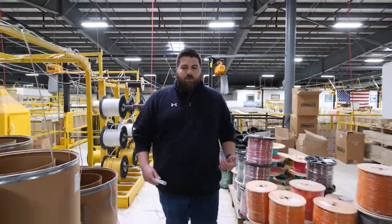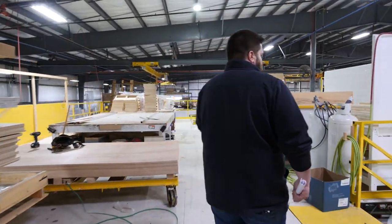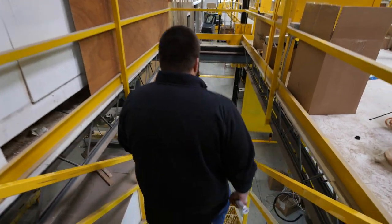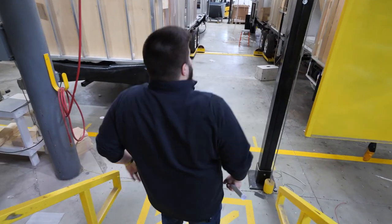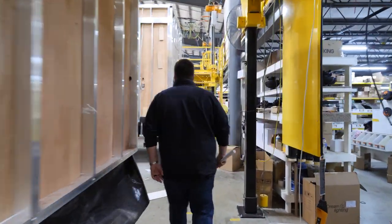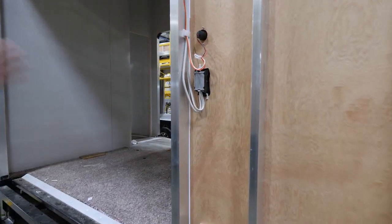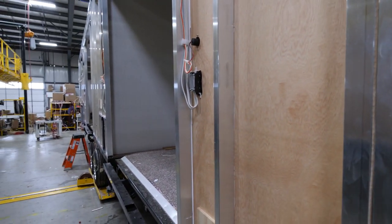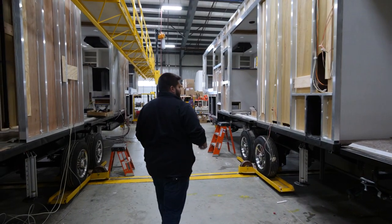One thing that's going to keep coming up is our wall construction. Being a hung wall, building the wall in-house, we have full control over how the electrical is run. You're going to see a lot more 110 outlets on exterior walls — with wool insulation going up the wall, you can put it over wiring or over the back of an outlet. So instead of having all your outlets on interior walls, we've got them on exterior walls. If we need to move an outlet, we can do it — we don't have to coordinate with a lamination facility across town.